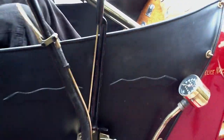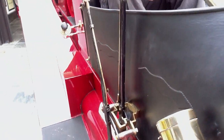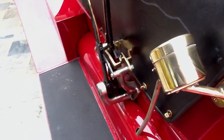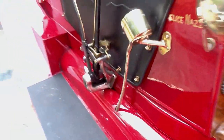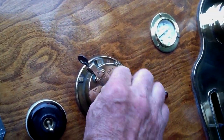The next procedure for starting this: it is a four-speed transmission, and the handbrake is also the shifter, and the shifter is also the starter. It's just in the position that you're in. So by pushing the button and going forward, we're going to hit the starter. As soon as it starts running, we push in the compression release.